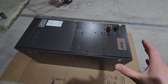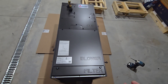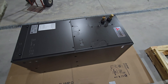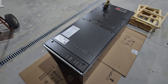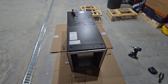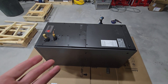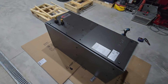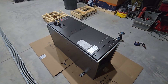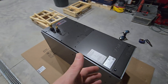I've never personally used these units before, but I've heard nothing but amazing things — super efficient, super quiet, really good quality. Taking this apart, it's just super modern, sleek, and very lightweight. Pricing was not bad — I purchased two for around $3,200. My plan is to connect both units to a single outdoor unit using a branch connector, so one line set connects to the outdoor unit. That branch system divvies up the necessary BTUs depending on which unit is calling at any given time.